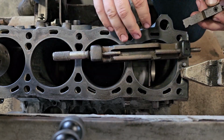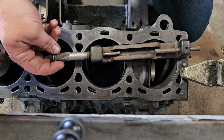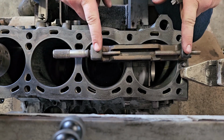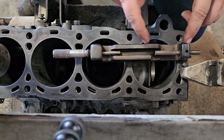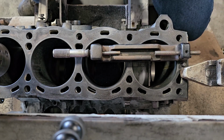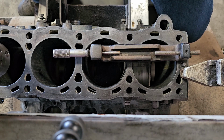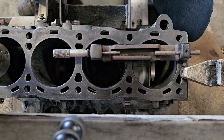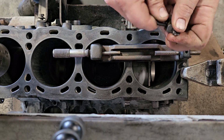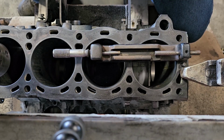So this is a micrometer. This is a Starrett, just a normal Starrett micrometer, but it's got a special gauge here. So you're actually going to set this, adjusting it to your cut. So you're going to take a base cut, and then you set your measuring tool to like a set depth.